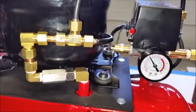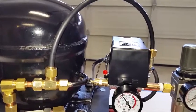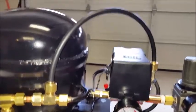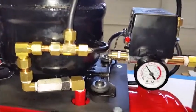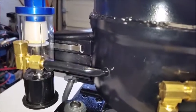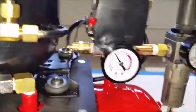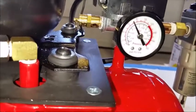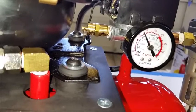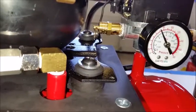Hard line plumbing coming back around — I ended up using a plastic line for the unloader since I didn't have a way to bend the copper line the way I wanted. To remove it, you just take off the four mounts and feet, unplug the power from the back, take that cap off, loosen it and slide it off — but you'll also have to remove that safety valve so you have enough room to slide the pump forward. The mounting screws are repurposed from the original Harbor Freight unit — I think they're 6 millimeter.